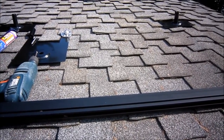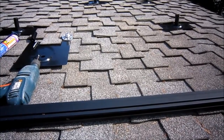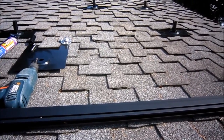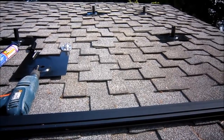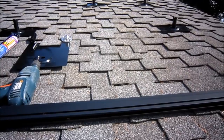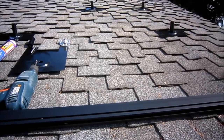You'll know because when you drill your pilot, if you're only going through the sheathing, it'll just pop right through after burrowing for about an inch. You need to be hitting wood for the full inch, inch and a half that you go through. I keep a spare drill bit in my pocket to stick in the hole afterward and make sure it's bottoming out on wood. You can also tell by the shavings pulled up by the drill that you're hitting real wood.